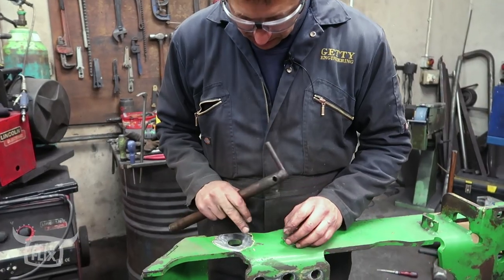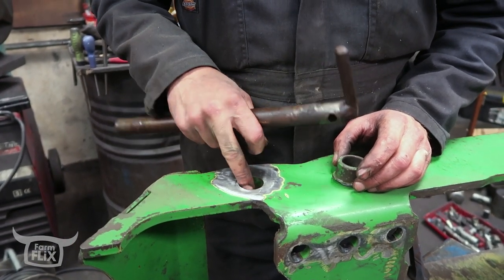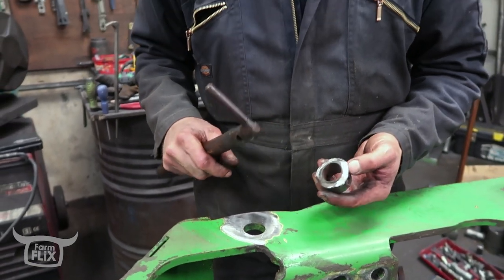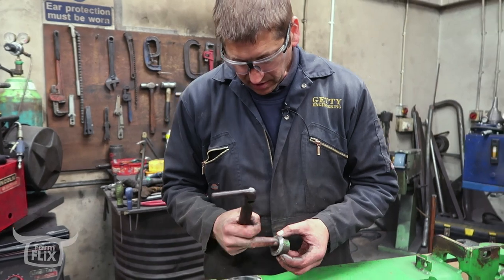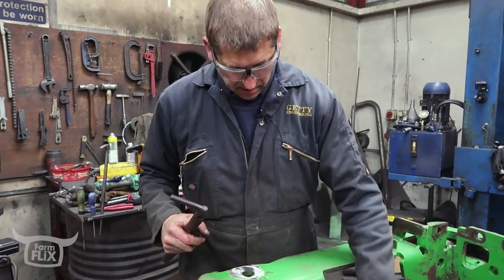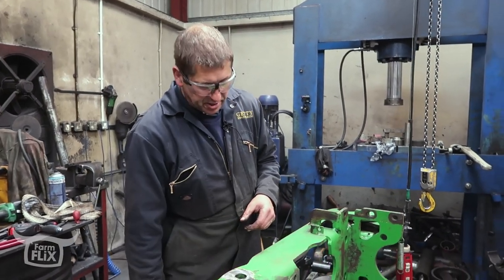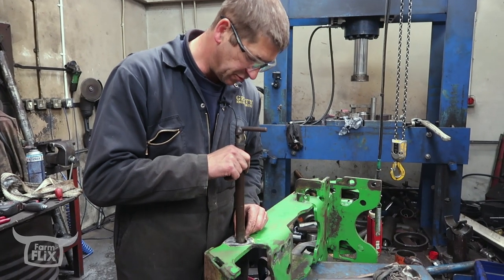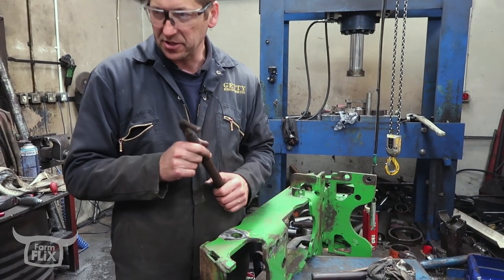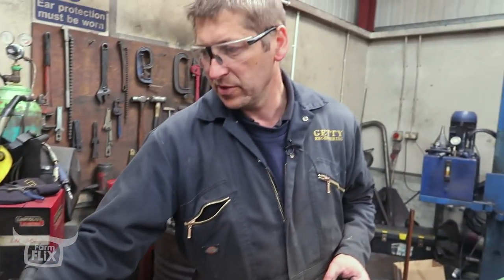Your boss now will sit where it's at originally, and down through this existing hole here, so you're going to end up with two thirds more metal. Would that ever need grease — would you put a grease nipple on it? No, that won't need grease because the whole idea is to keep it fixed in this, don't let it turn in there, and then it turns in the other bit. Because that's a tube from one side to the other, so there's plenty of wear surface.